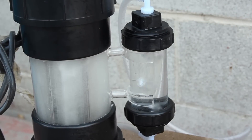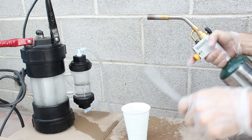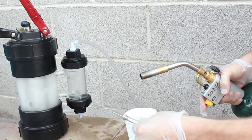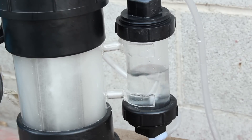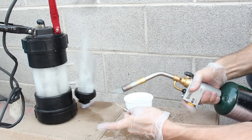Some people might ask what the purpose of the bubbler is. Well, it helps clean the gas, but more importantly, it acts as a flame arrester in the event of a flashback like this. If that flame were to get back inside your generator, it would probably do some damage. The bubbler cap is just pressed on, so if there's a tiny flashback explosion, the worst thing that happens is the cap pops off. If the bubbler is a little low on fluid, then be careful, because now the gas has a place to build up, and if you were to get a flashback in that situation, it could be a little more dramatic.